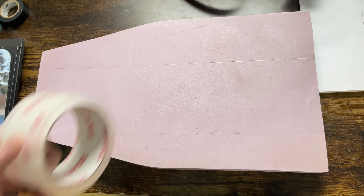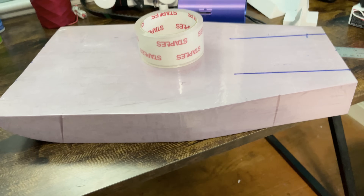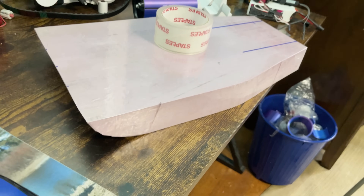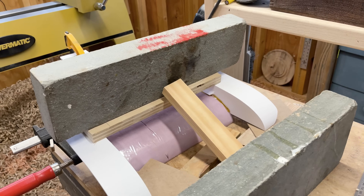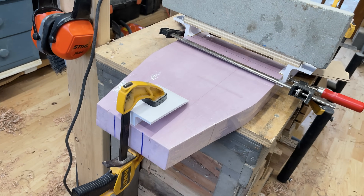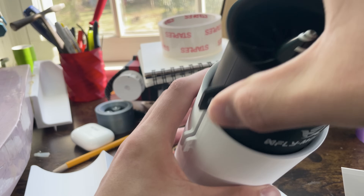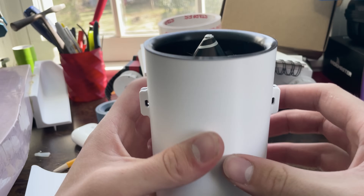To protect the foam a little bit, I decided to wrap the thing up neatly in packing tape. This would also help the water separate more freely from the hull's surface. I used some general purpose Gorilla Glue to attach the hydroplanes to the chassis and let it dry overnight. The final thing to do before giving this thing its first drive was to glue on the mount which would hold the EDF sleeve as well as the rudder bracket.